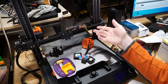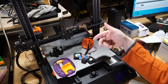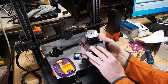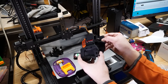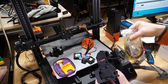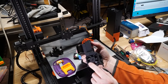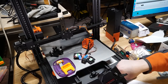The beautiful thing with the DDS is it has everything it needs: a part cooling fan, a BL Touch mount, and an always-on fan. I got this special from Bontech without the E3D, and I happen to have an E3D right here. This is a 24-volt heater, so we're good there. The fans Bontech included for part cooling are 24-volt fans, so I don't have to run any buck converters — I just have to jumper the voltage.